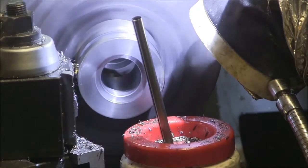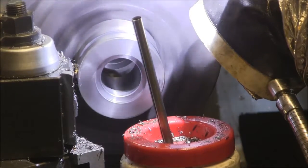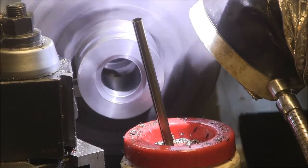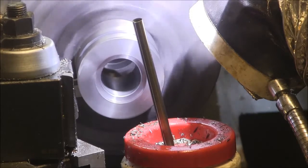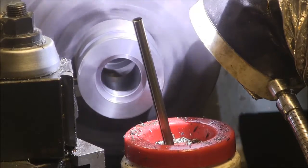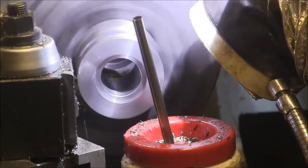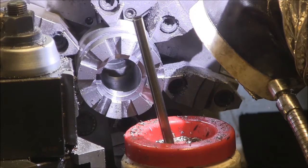So we're down to depth here. Let me just slide it sideways — first you've got to be able to see what you're doing. What I'm doing is just taking a very light cut across the bottom here with the parting blade, just to make sure that it's flat across the bottom.